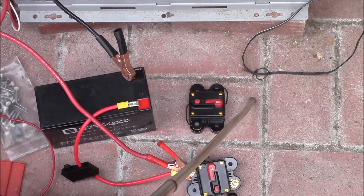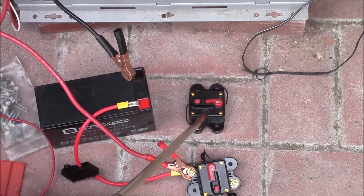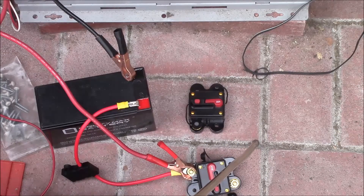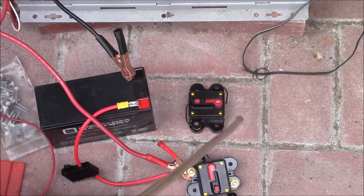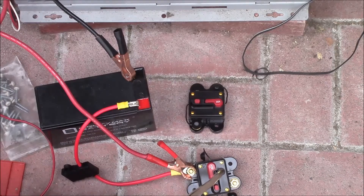The loads are on this side. This way I can, for instance, if I need to discharge or charge the super capacitor, I can open this breaker and then charge or discharge the super capacitor, remove it or do whatever I need to, and then close this breaker. And likewise I can disconnect the charge controller if I need to.